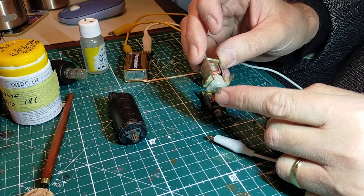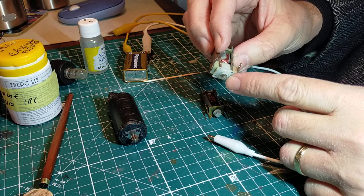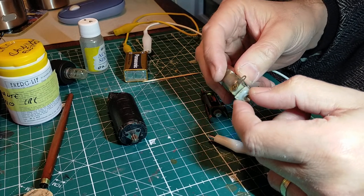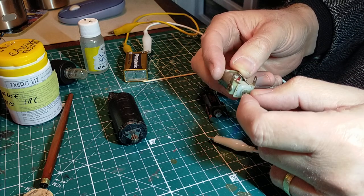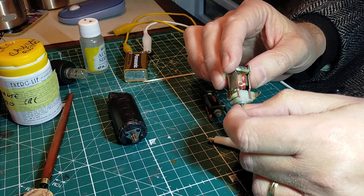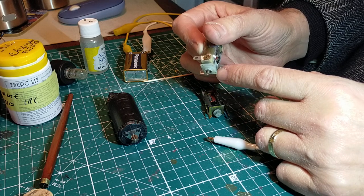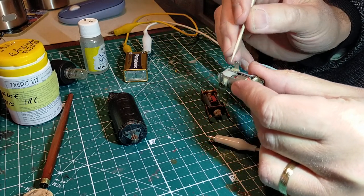This is easier to dismantle, because I suppose that by taking the brush holders out, at that point I should be able to pull this plastic bearing out completely. I've never opened a Jouef motor because the Jouef motors I have work very well, and this type of commutator does tend to get less dirty compared to, for example, a ring field motor.